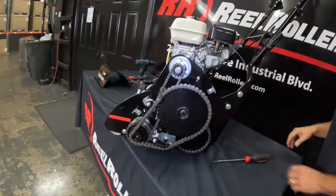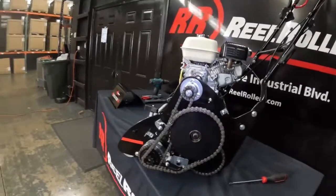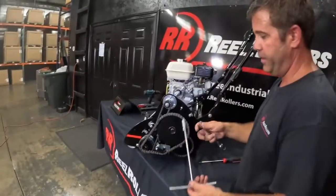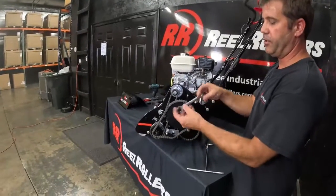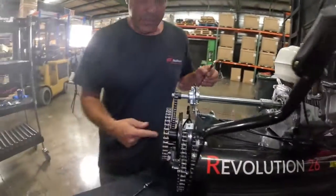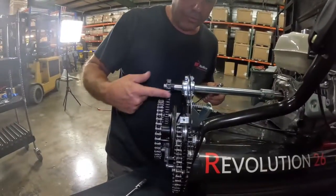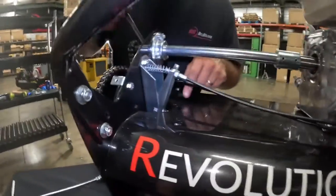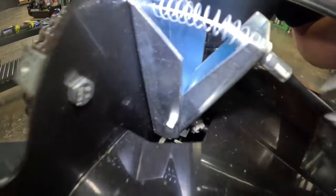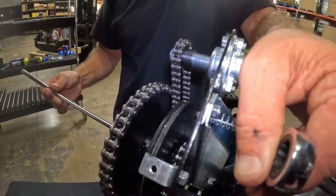In the event you're not getting enough pull or climb out of the mower, it's a super simple fix. I've got my reel-to-bed-knife tool — this is useful for anything you can think of — and an open-ended 13 millimeter box wrench; a half-inch would work fine too. Getting on the other side so you can see this particular bolt, which engages your ground control and slides these pads into one another. It runs all the way through the mower and is at the very bottom of this lever. To loosen or tighten it, I take my box wrench and put it on the nut, then take my reel-to-bed-knife tool and put it onto this nut.